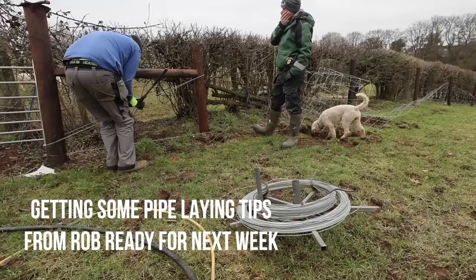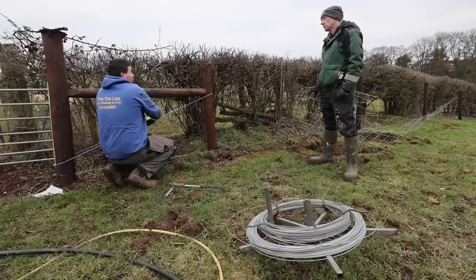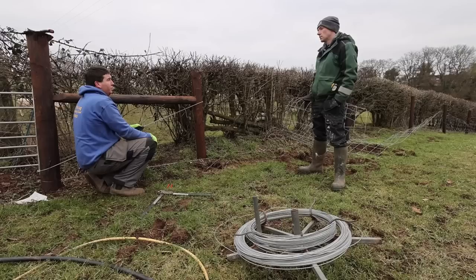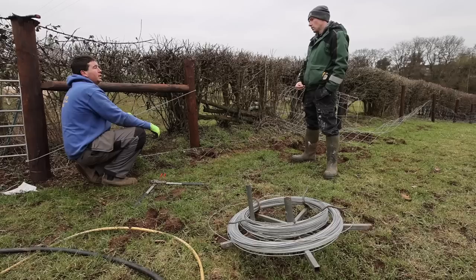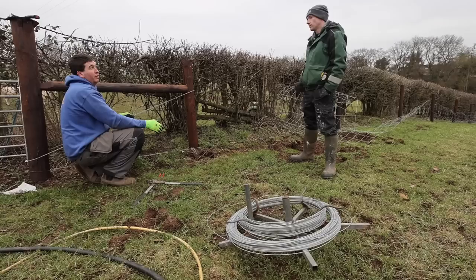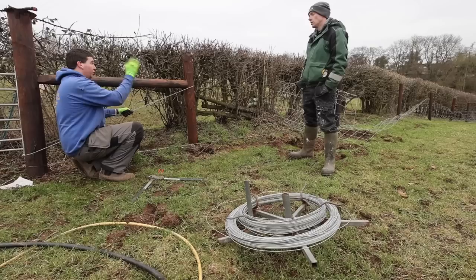Have you got a mole plow? Yeah, sort of like the little one that you piece the pipe through at the same time. What I normally do with that is pull the mole plow through first with no pipe — do one where you're going to go, try and do your straight lines if you can, and pull the mole plow through first with no pipe. And I'd also lay the pipe out. But I'd still go through first so you've got a bit of a looser grain without trying to pull the pipe. Because if you go three foot and get stuck, you're then lifting your pipe up and down trying to get going. Whereas if you go through first, that loosens it and doesn't give the pipe so much stick either.